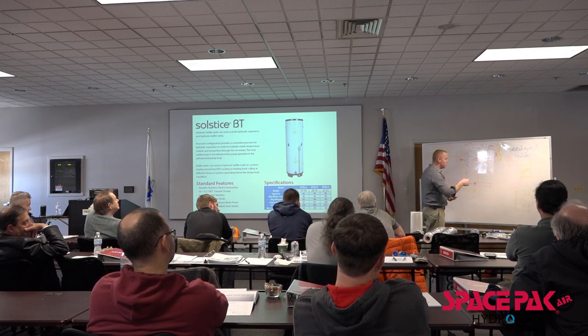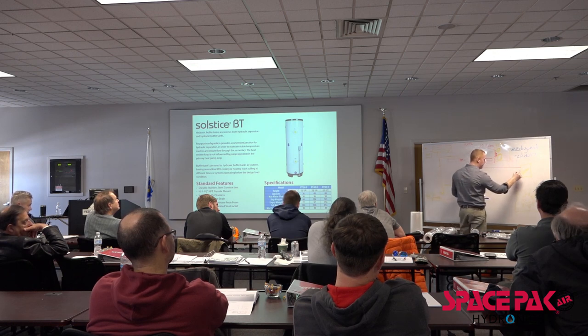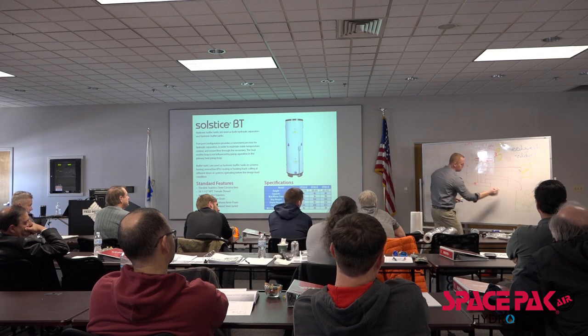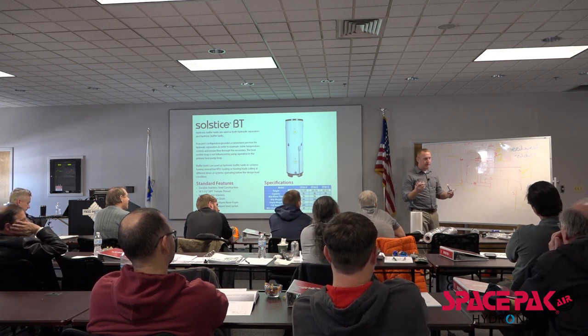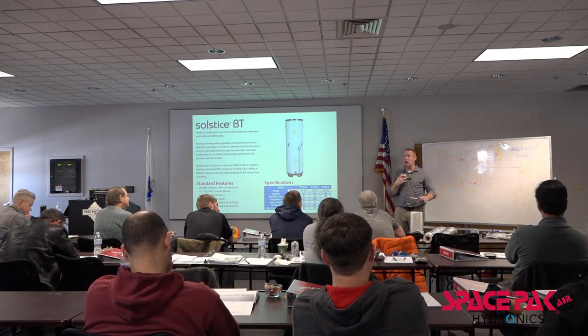Keeping that in mind, with a series of check valves, right, we can come in and tie into this with a boiler. You know, we can tie into it with a solar tank. So depending on the temperature, okay, we have a control, we'll talk about it, it's called the SSIC control, and based on outside air temperature, it will choose what we want it to do.